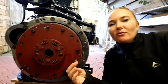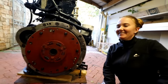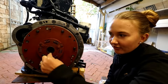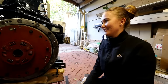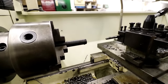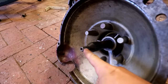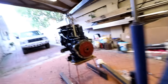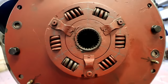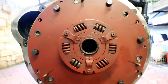The whole engine has been assembled. This is where our stern drive mounts — the shaft goes into this hole and then this goes in our boat. We're sizing the alignment pin here, which takes the drive of the stern drive into the center of the engine bearing. That alignment pin will fit over this one and keep it perfectly straight so that we're centered with the inside of the engine bearing — we need those two to be perfectly straight so we don't have any vibrations or distortion. Everything fit like a glove, so it's time to send our bell housing to get sandblasted.